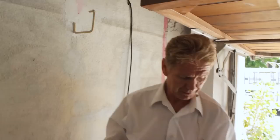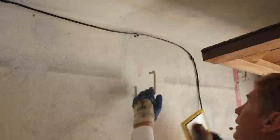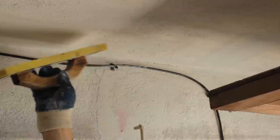So that's done. It dried out. Why is it drying out? Because the Structolite — the perlite, the volcanic glass — is sucking the moisture right out of this. So I put some water in. What we want to do is just take it lightly and feather in that joint a lot better than the other fellas. We're professionals, so we have to do it a little bit better.